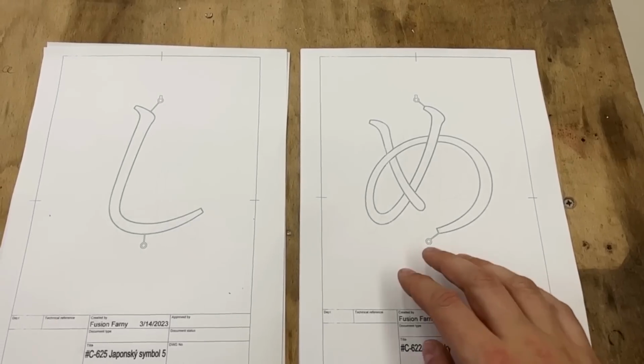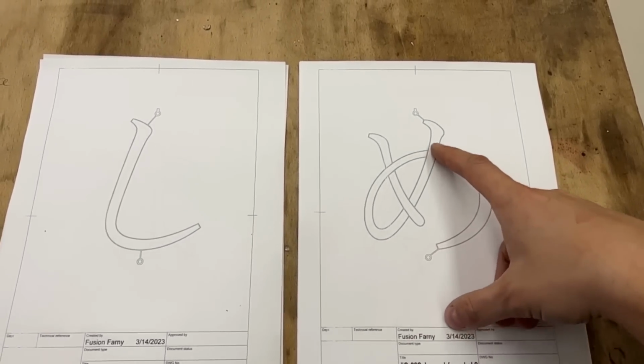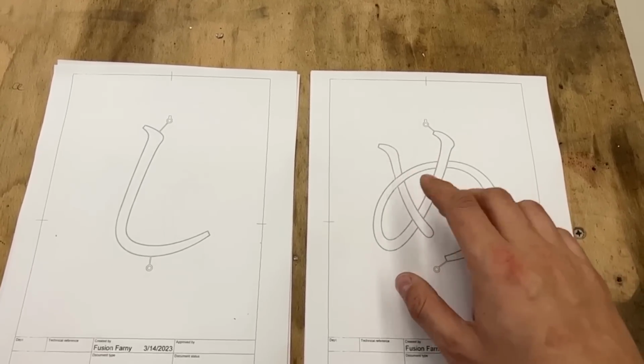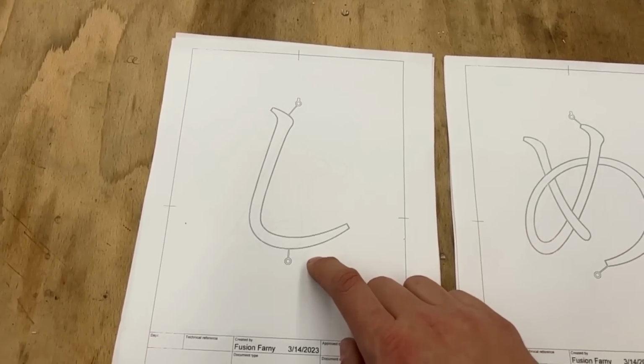We made and packed more than 121 Nixie tubes, but we didn't finish the 7 special symbols. We have a few of them finished, but we need to make another full set of these 7 tubes and take them with us. The tubes with this complex symbol turned out well. When you look at these tabs, all this heavy part is held in place only by these thin tabs, so it's flimsy and it tends to touch all the other surrounding elements. But this one went well, and this simple one failed repeatedly.